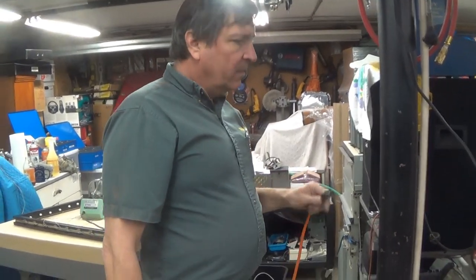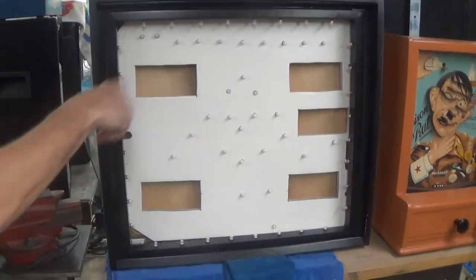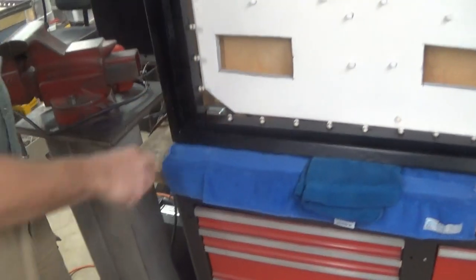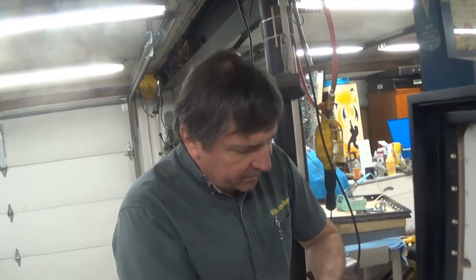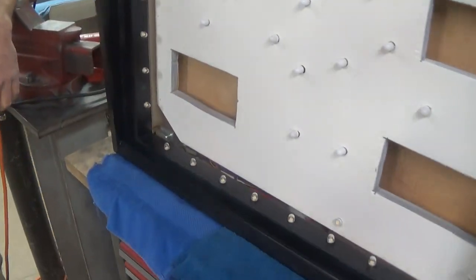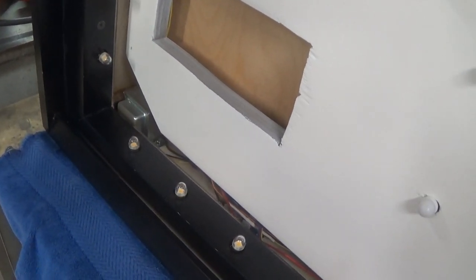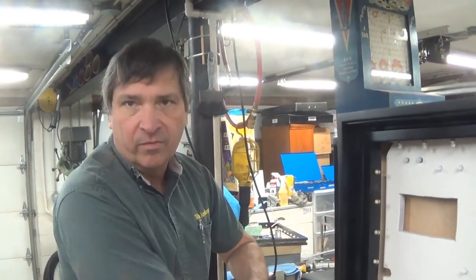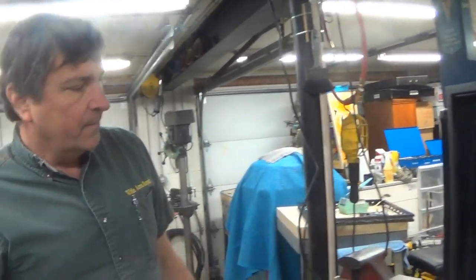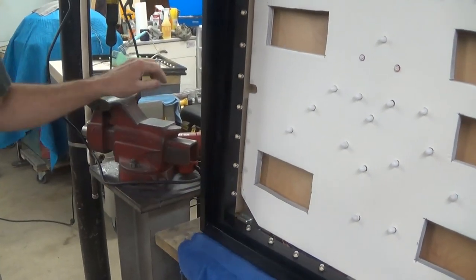Anyway, this requires two plugs, one for the 12-volt adapter and one for the GI lights, which is a transformer-driven piece. Okay, and this is all electronics as designed by you? Yeah, this is a center tap transformer, which means it has two legs. One is 6.3 and the other 6.3. I'm splitting it. You can combine them and get 12 volts out of it. It's a hobby transformer. Okay. It's big enough to do what I'm doing with LEDs. It probably would even power incandescents.